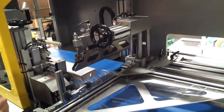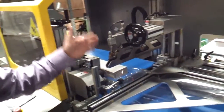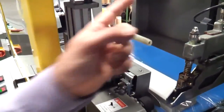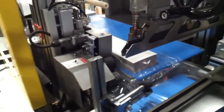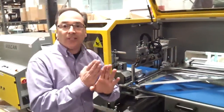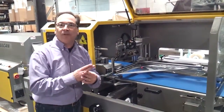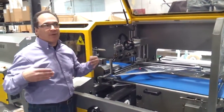This cutting device, unlike a lot of machines that you've seen us promote in the past, doesn't cut in an L. It's simply cutting the leading and trailing edge of the film. And our side seal open-end sealing device, controlled by this plunger, is designed like my grandfather's shoemaker knife, where he just plunges through the film, a Teflon-coated heated blade, and that heated blade simply cuts the film and seals it like a hot knife going through butter. No moving parts, no wires to blow. It's a hunk of steel that's Teflon coated that the film just simply hits and glides and cuts and separates.